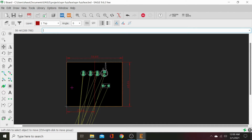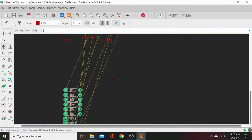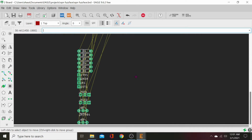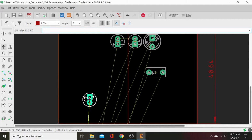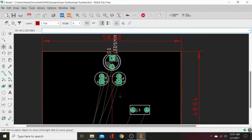And we'll look at our schematic. Our 2.2 is C1. I don't know where I left C1 at. Oh, well, that's right. I pulled this. Let me annotate that. C1 is actually our box cap. C2 is our input cap. So I'll grab the move tool, grab it, pull it down, and we'll just set it over into here. Let's grab our LED, move it up into the center. Let's see which ones are. C2 is our distortion cap. Oh, that's right. I changed those. Okay, here's where we drop this, and we go back to our schematic and take a look.